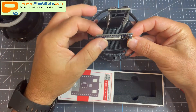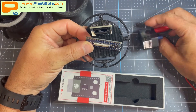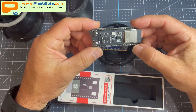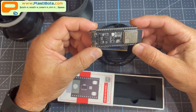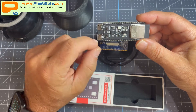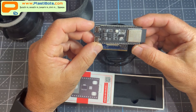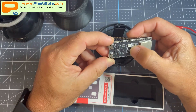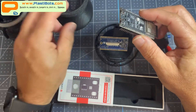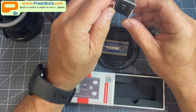As noted, the connectivity to the OBD2 reader is Bluetooth, so I don't need extra wires for that — I just need to get power to the ESP32. I may wire in a switching regulator to the 5-volt VIN pin on the board, or I might just hack a USB micro cable to make it more plug-and-play. I also noticed this board has an RGB LED, so I could get some fun glowing effects inside the vent if I wanted.